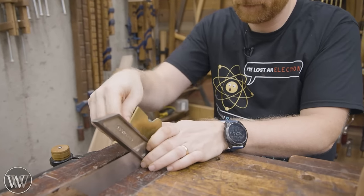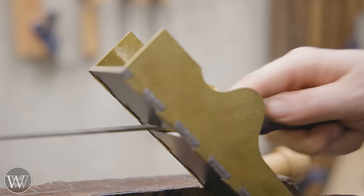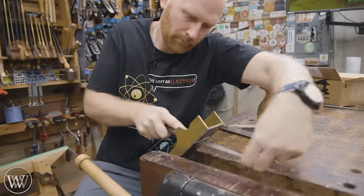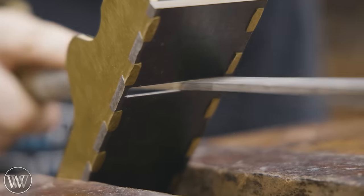Speaking of the brass body — the steel sole on the bottom comes with the mouth at square edges, and I want to file that back to a 45 degree angle. This 45 will then match with the 45 on the handle. I want to do it before I get the handle on there because it will make the filing work so much easier, since the handle itself will not be in the way.